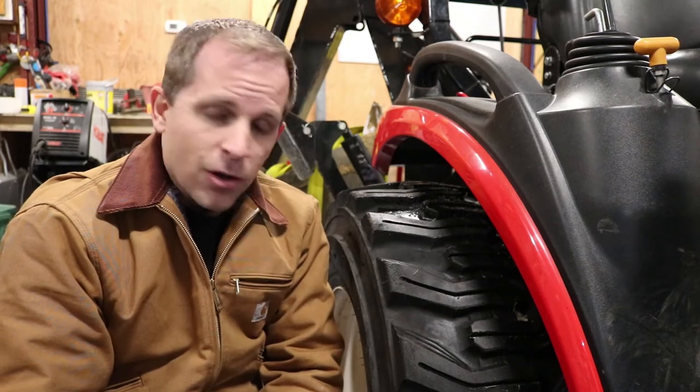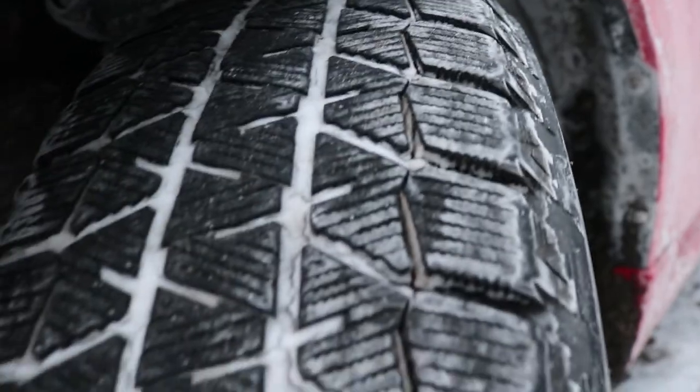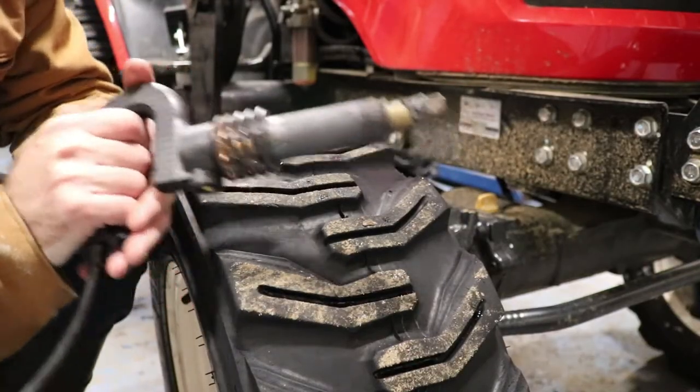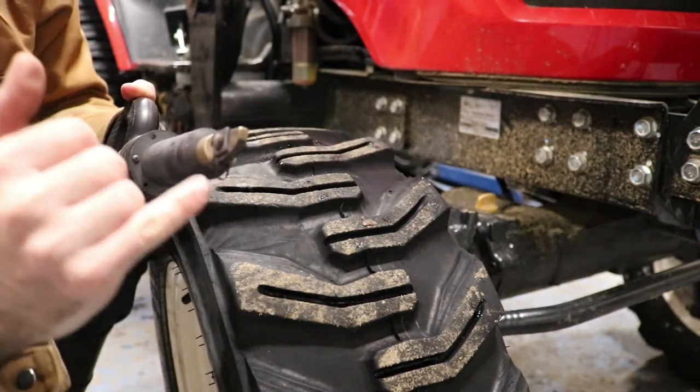Something you can do if you feel up for it is doing what they call sipes, which is basically small cuts in the tire tread that will help capture the snow a little bit better than these grooves. They're a little bit on the large side. This is the tool you need to use. As you can see from the end, it's got this little sharpened bent piece of metal that you can adjust